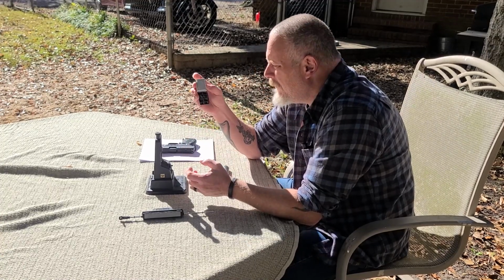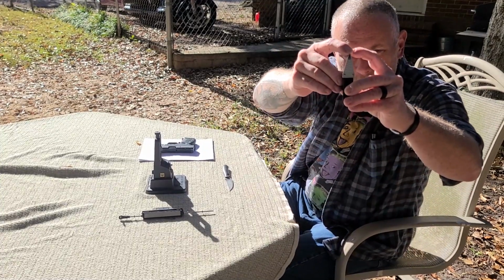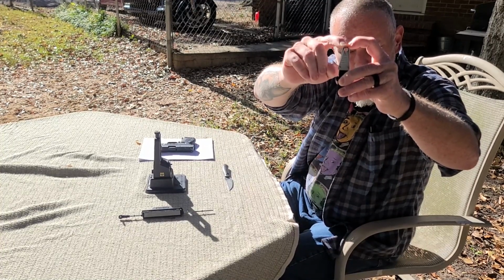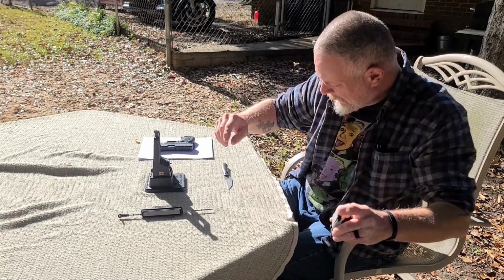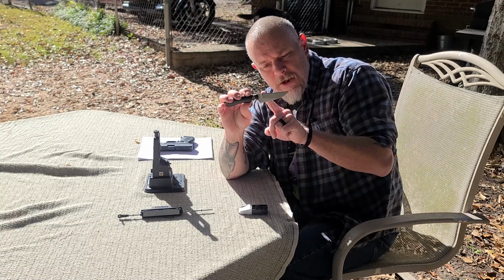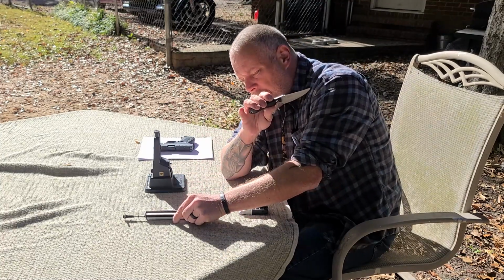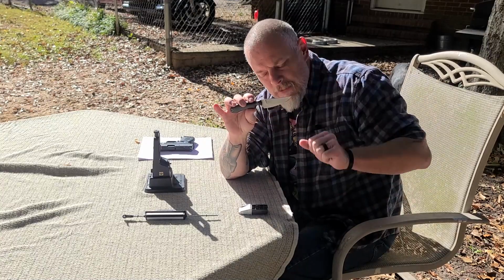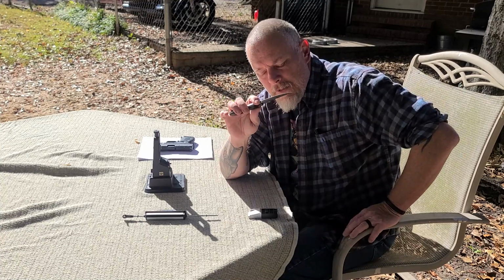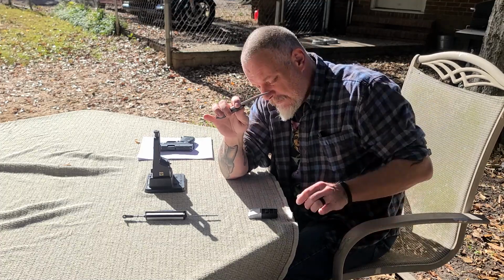The blade clamp feels a little flimsy, but I'm going to hold this up to the camera. It's actually designed pretty well. It's 2 jaws and then a nice little V there that will hold most of your knives quite securely. One of the reasons we're working with this knife today is twofold. It's got a slightly curved edge, so that's going to make working with these stones interesting and see if they're small enough to actually meet that guide. And the profile on the back of the blade is difficult to hold secure in a number of clamping systems. So it'll be a really good test for this.